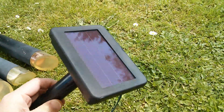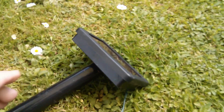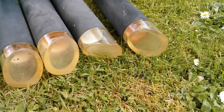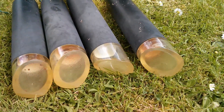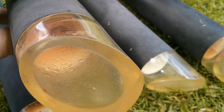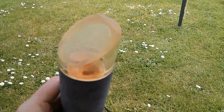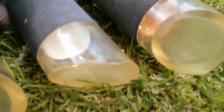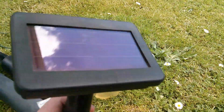This one's quite interesting — Sainsbury's supermarkets again. It's got quite a large amorphous panel and a single rechargeable cell. Out of the four light sticks that came with it, three have failed. You can see the one that's still working — nice and clean inside — while the others have gone all manky and brown. Inside the plastic cases there's condensation. What appears to happen is that although the top glass-plastic is reasonably well sealed, moisture gets in, condenses when it gets cool, drops into the little plastic bowl, and destroys the LED.